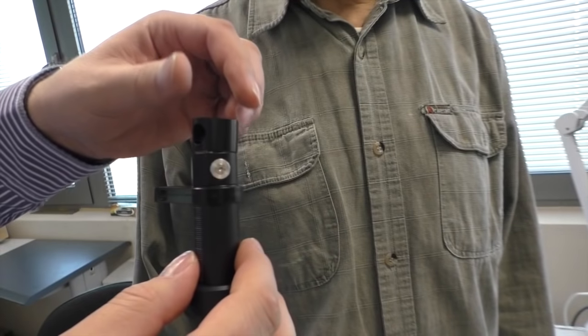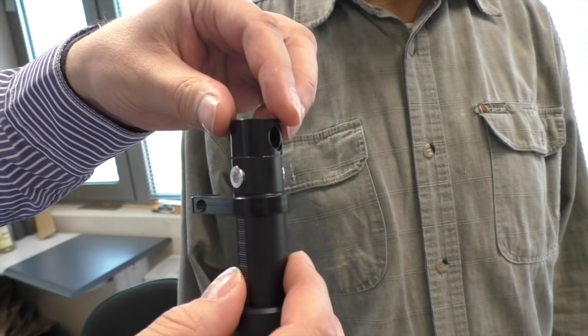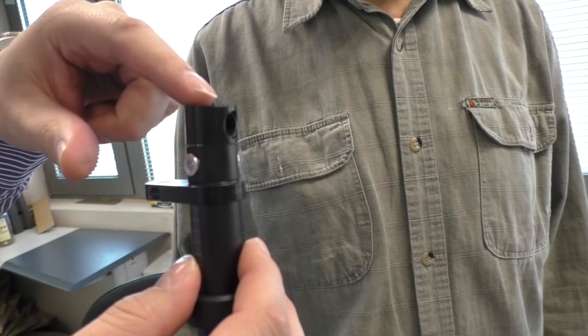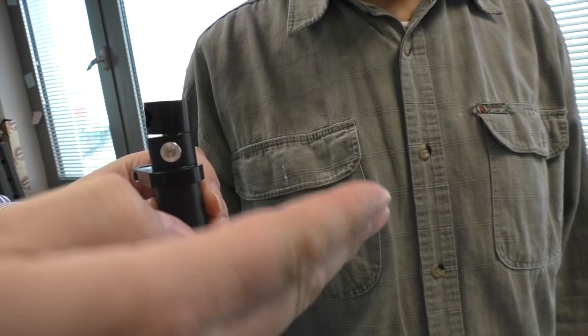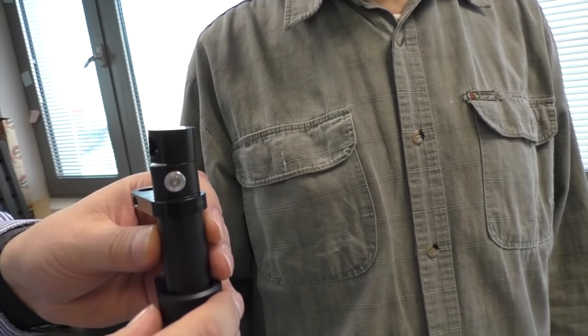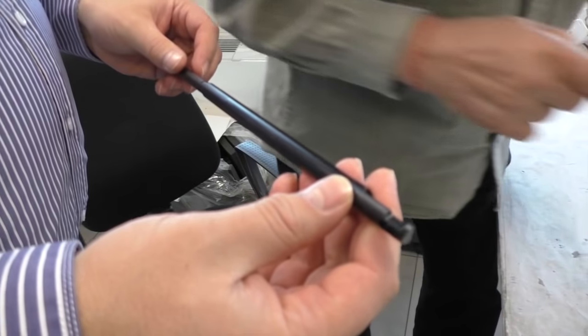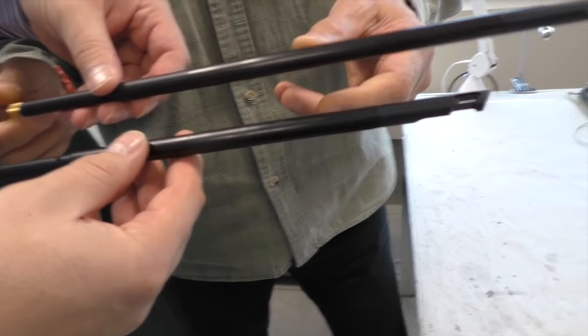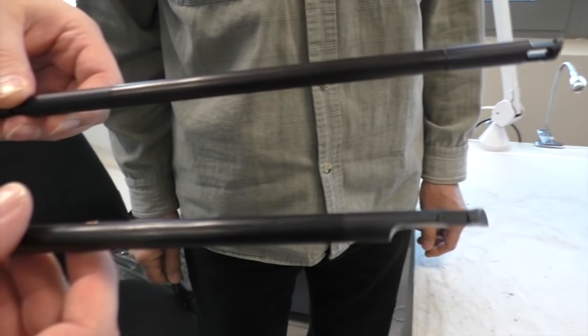So when the tone arm moves up and down on a warped record, the vertical tracking force doesn't change, because the counterweight sinks underneath the bearing and also changes the weight proportion accordingly. And also there are different arm wands, different lengths, 9-inch and 11-inch, 282 and 239 millimeters.